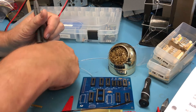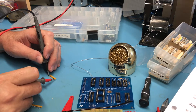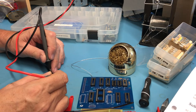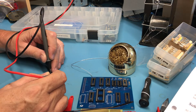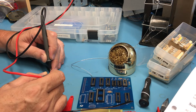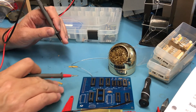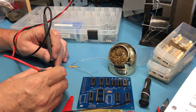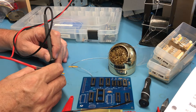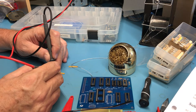I need to go to ohms. Pin one is common — this is labeled 10K-1-103. Pin one's got the dot on it, so from pin one to each of the other pins I should find 10K. Testing: 10K, 10K, 10K, 10K, 10K. Easier to test now than to put it in and eventually discover an open resistor. Those all measure fine. I'm measuring on the static dissipative mat — the resistance is so high that any influence on my measurement is negligible. I'm just looking to make sure I have about 10K in each resistor position, which I do.